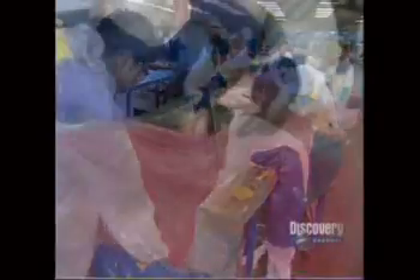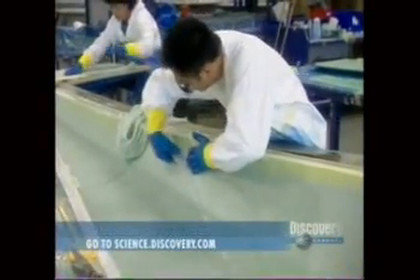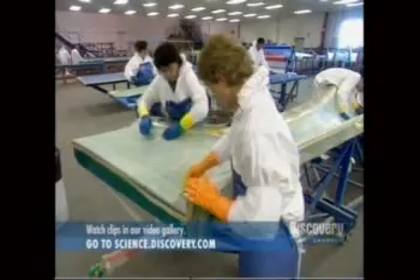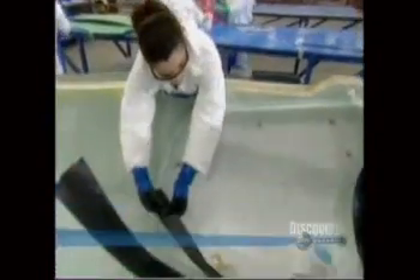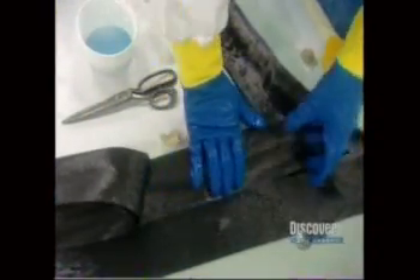To begin forming the various parts that make up the body, workers lay strips of the laminated fabric into molds. The engineering plans dictate the precise positioning of the strips, which is critical for strength and durability. They lay in carbon fiber cloth where they need to have extra strength without additional weight — like areas such as the passenger compartment of the cockpit.